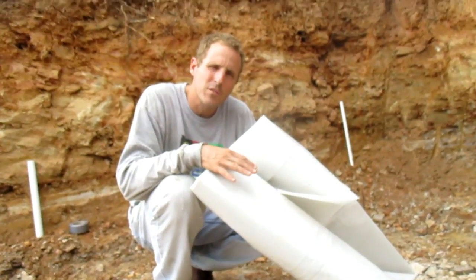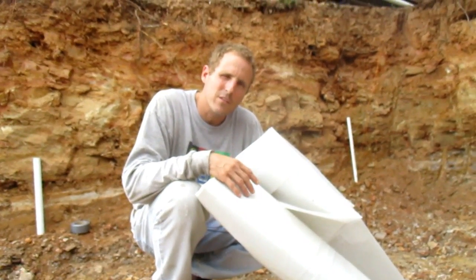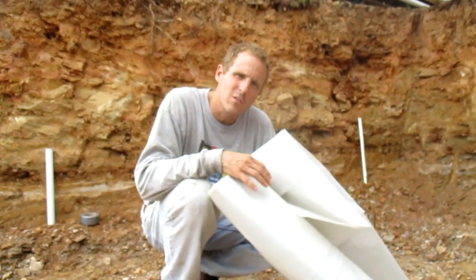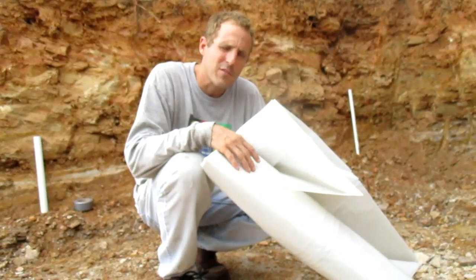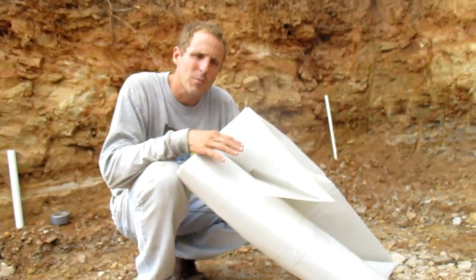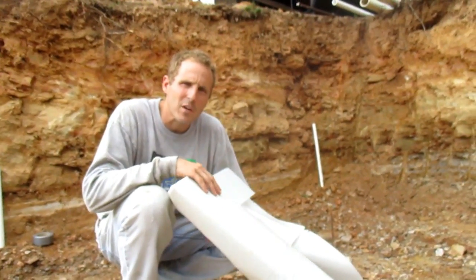And we do know that a root cellar does require a certain amount of humidity. But we would rather take steps to control the humidity inside there with some other measures, which we'll get to later on when we're actually storing fruit and vegetables in there. But right now we want to give ourselves a nice little vapor barrier and a little protection on the bottom. So we're going to go ahead and install our plastic. Then after that we'll set our rebar on it.